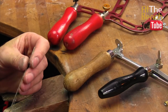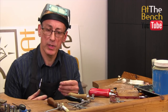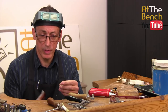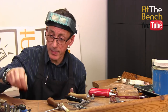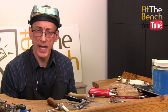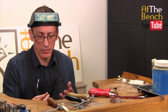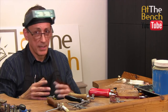When you come to use very, very fine blades, you've got to be really careful because they're very delicate. You must not put too much pressure on the blade or push against it, because they will break. You've got to pay more attention and go a lot slower. The cuts they produce are really, really fine. If you use thick blades, the thickness of the cut is going to be wider — you'll lose a little more material and they're more robust but harder and more aggressive to cut. That's why I only occasionally use the thick blades and the very thin blades.